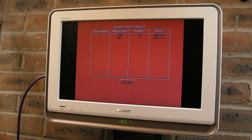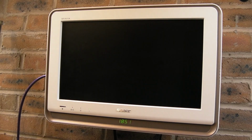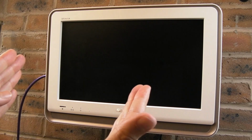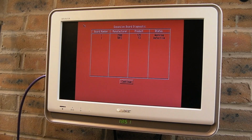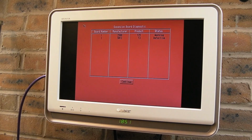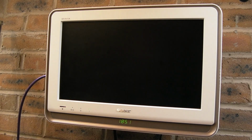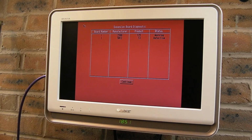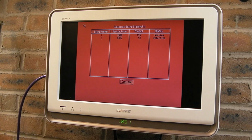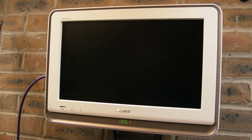Yeah, and here's that reset problem that happens after about 10 minutes. It just starts resetting, and the gap gets narrower, narrower, narrower. It tells me that it's temperature related, actually. You can see it's just getting more and more frequent. Before we know it, it'll just be going reset, reset, reset. What I need is the SID card in here to see if it's going ding, ding, ding, but I'm guessing it is. So it could be a problem with the reset circuit.